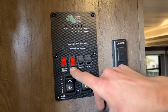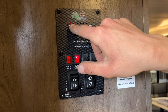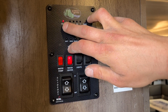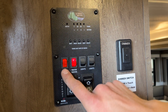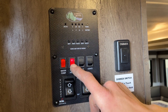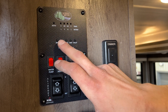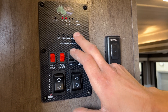There are two red switches. The one on the right is your water heater — turn it on and a red light lets you know the ignition sequence has started. It'll try three times; if it hasn't fired up after the third try, the light will stay on — just turn it off and back on to reset. The switch on the left is your water pump, which draws from your fresh tank to pressurize your lines. On top is your monitor system: batteries on the left show C for charging, G for good, F for fair, L for low. Your fresh tank will show one-third, two-thirds, or full — same for your black, gray, and galley tanks.